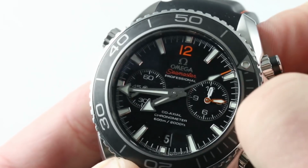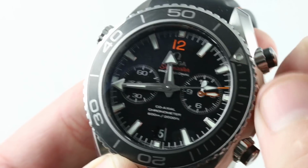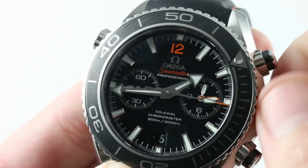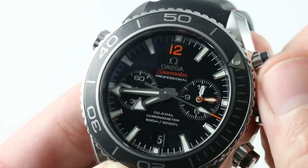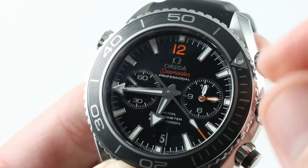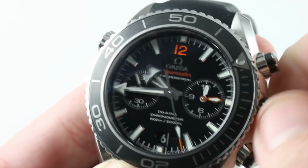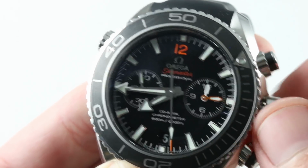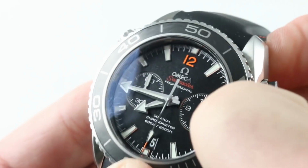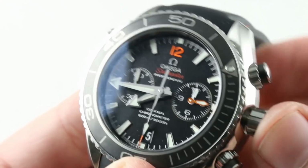You will note that, as with all caliber 9300 and 8500 derivatives, save the date 8 and a few specialized variants, you have that time zone functionality whereby you can jump the hour in 1 hour increments, and as you travel you can change zones. You can even travel both directions across the international date line and roll the date in both directions. Pull the crown out to extremity and you have hacking or stop seconds, so you can halt everything and synchronize to a reference time.